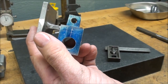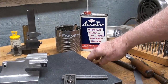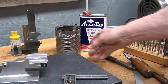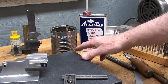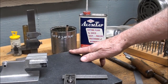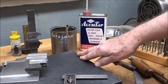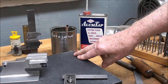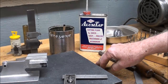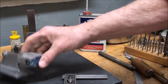I have been asked numerous times what kinds of fluids I use for drilling and tapping aluminum. There's aluminum tap fluid — there are all different brands that work quite well, but it's costly. Kerosene is much cheaper, so I use a white kerosene, like you use in a heater. WD-40 — plain old WD-40, I got a whole gallon of it — sometimes I put some of that in the can. That works very well too and doesn't smell very bad either.